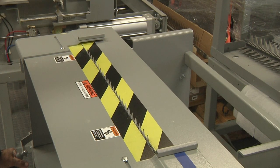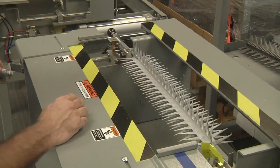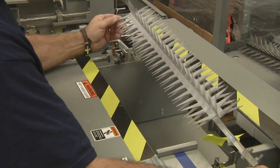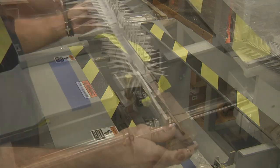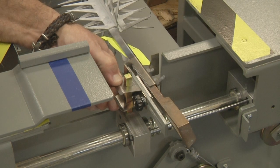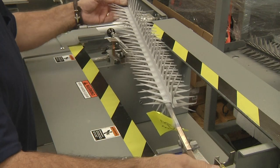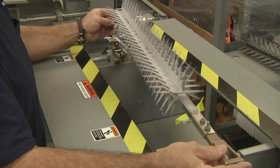Push the foot pedal and you can load your parts. We have to remember that the symmetry of these fingers is not equal, so each time you do a rotation for a longer side, you will have to adjust the heights. This little spring clamp is how you adjust the height. This rack has long fingers that are a little bit taller, so you bring it down a little. Two equilateral sides should work fine, and the other two longer sides will work fine once you adjust them.